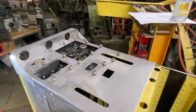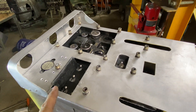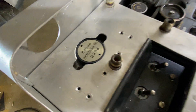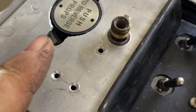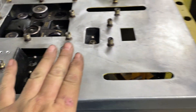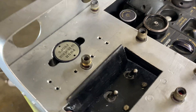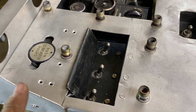I have done a lot back here. I'll show you this drawing I made before I take it off. What happens here is you've got your universal button, and it's actually recessed down in there because the button itself is about a half an inch tall. Convair, with their obsessive need to make everything perfectly flush, did some really weird stuff here. I've got these countersink holes ready for the rivets, because if you look on aircraft 52-2220 and 52-2827, you can see that there are rivets there.